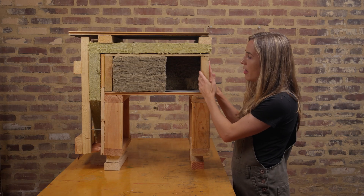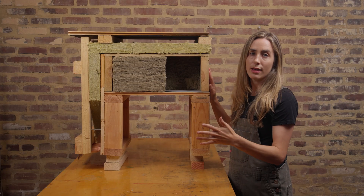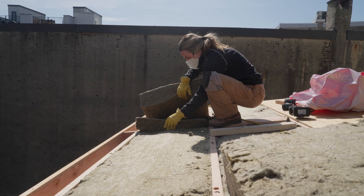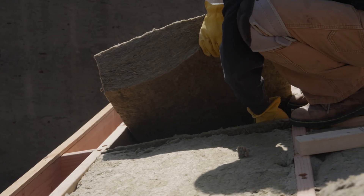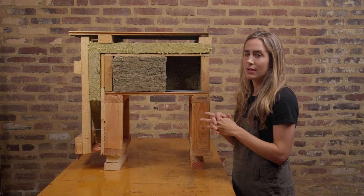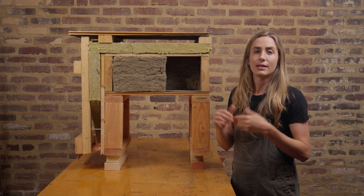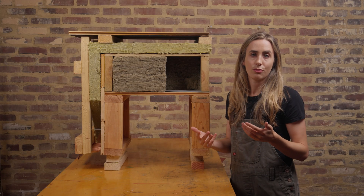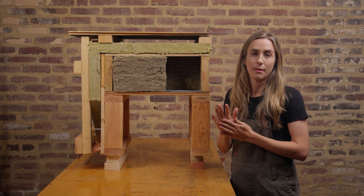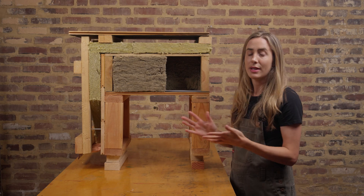Next up we have our bays for the majority of our insulation. This could be compressed or expanded depending on your insulation requirements and R-value needed for your project. Many of you might see that we're working with rock wool insulation today — we've got our batts here and our rigid comfort board up there that we'll get to in a minute. I would argue that rock wool is simply the best option most readily available in North America, and most importantly, if it gets wet it can dry out, which is not the case for a lot of insulation products. There are some exciting alternatives available in Europe, but as of right now this may be our best option based on availability and performance.